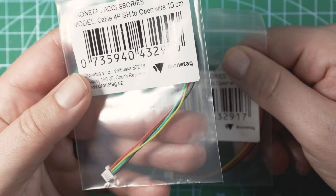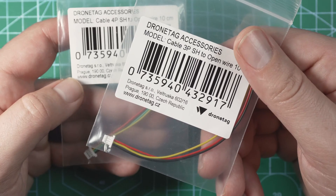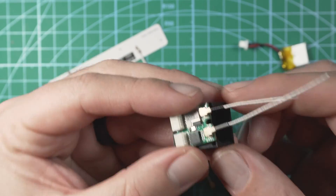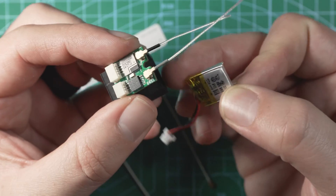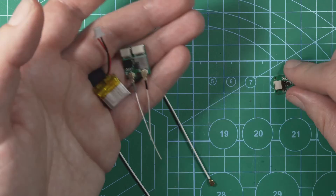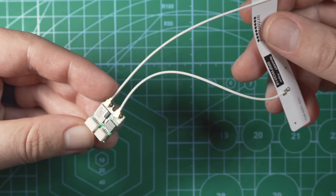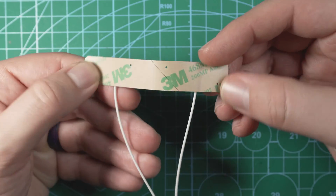The four-wire cable is the one I'm going to be using because I want to use the BS also as a GPS. If you don't want to use the module as a GPS on your drone, you can use the three-pin cable and you'll only have to connect two of those wires. DroneTag also sells a little case that holds the module in it, plus an included small battery if you don't want to do any soldering. They also sell an upgraded antenna for the BS — I've noticed a much faster satellite lock when using it. The included antennas work pretty well too, but if you're using this on a fixed wing where you have space to mount it, this is a nice antenna with sticky tape on the back.